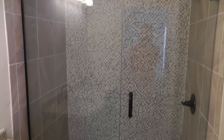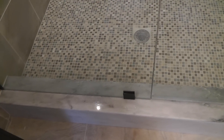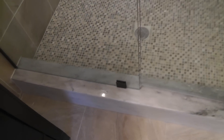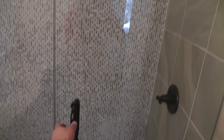Right here you see a frameless shower door — it's a clip and U-channel system, so a combination of both. You have the clip on top of the glass U-channel, which is a piece of metal that goes inside the glass, and nothing at the bottom until the corner of the fixed panel. That is why it's called a clip and U-channel system. This door will swing both ways.